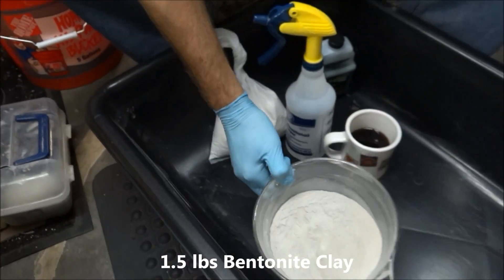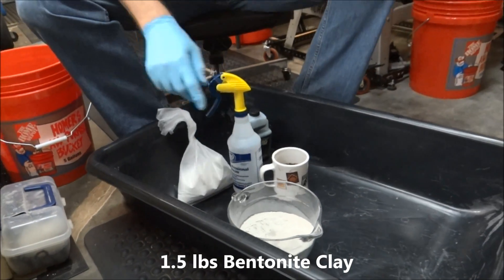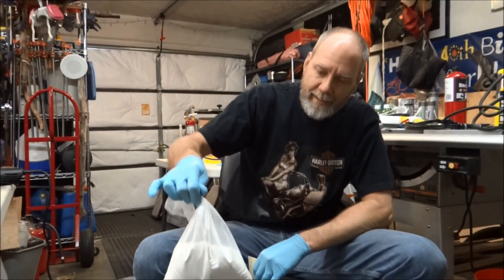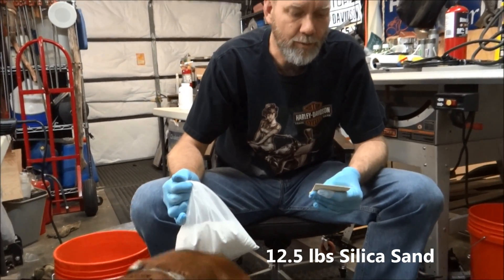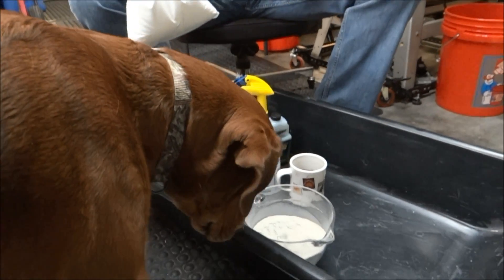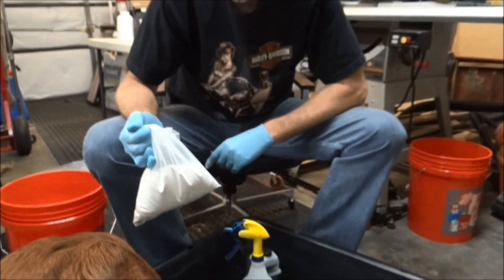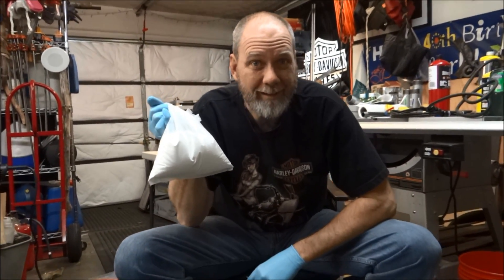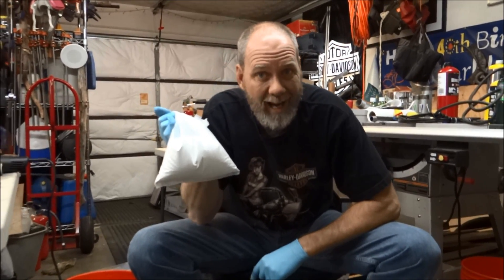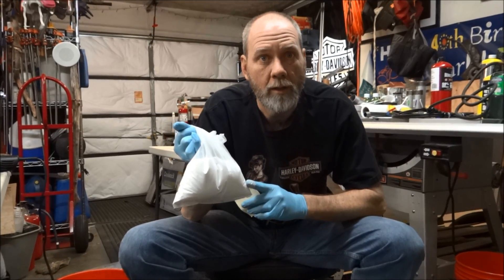For this recipe of bentonite, we're going to use one and a half pounds. And then you're going to need silica sand — we're going to use 12 and a half pounds of that to the one and a half pounds of the bentonite. Silica sand is the stuff that you get in your toothpaste and all that. I actually ordered this from walmart.com, believe it or not — free shipping. They sent me 50 pounds; it's for cigarette ashtrays or some crap like that.